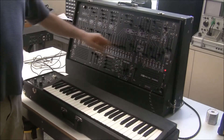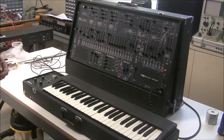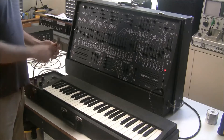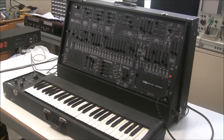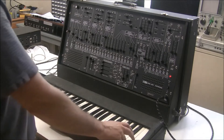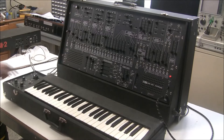Now that we've got the slider fixed and the other slider caps on, it's time to take care of the keyboard. The problem is it loses or glitches the keyboard control voltage if the cable moves. From wiggling the cable, I think the issue is the female connector, so I'm going to cut it off and put a new one on. I wound up changing both the connector on the cable and the connector on the keyboard. Now I can wiggle this all day long, and it's not going to affect the pitch because this connection is now solid.